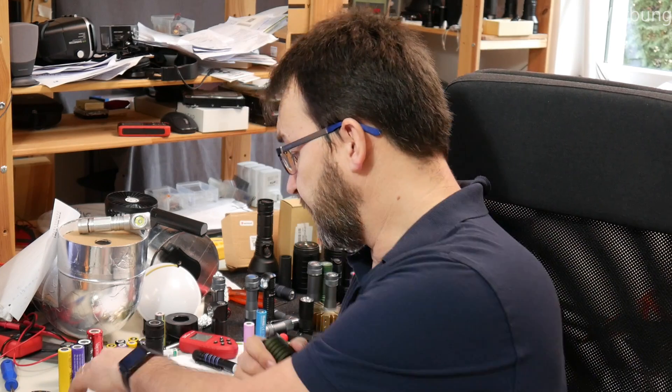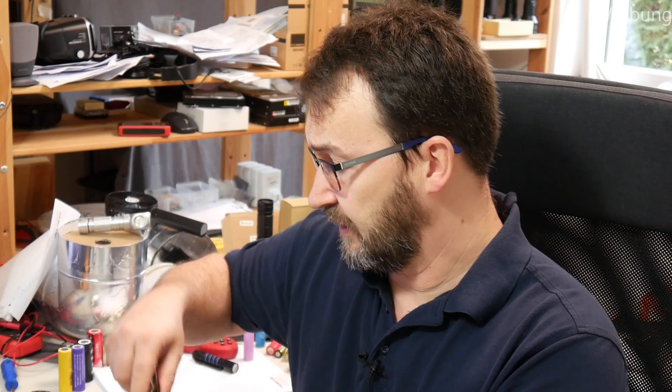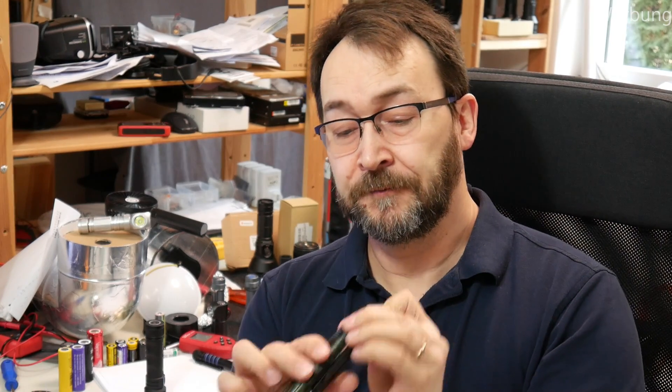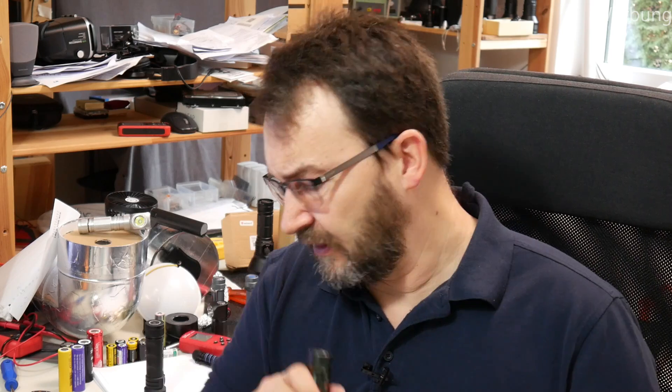I can prove this — it's the same for the M2R Pro Warrior. You can put the battery in there and with a non-conductive finger covering the contact hole, it still works using the side button because the switch is on the driver itself. On the other hand, the Warrior X Pro doesn't have a side switch, so you cannot trigger it — even if you try to short a wire to jumpstart it, that doesn't work. You need the special resistance so the driver can detect the switch. And with a regular 21700 battery without the negative contact, it does not work in the M2R Pro. I also tried an 18650 with a reducer — it does work, but when you go to turbo, the 18650 trips the fuse and shuts off.